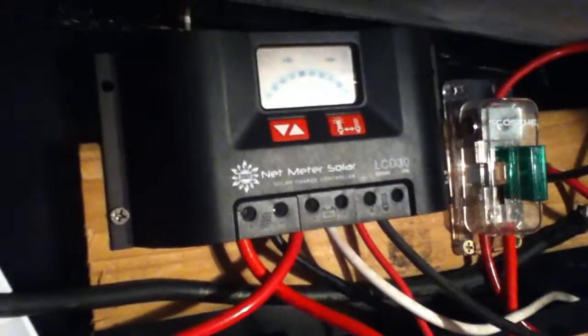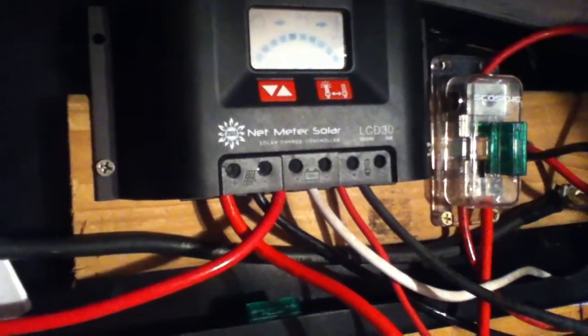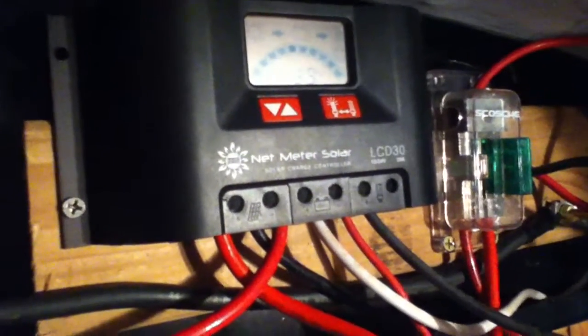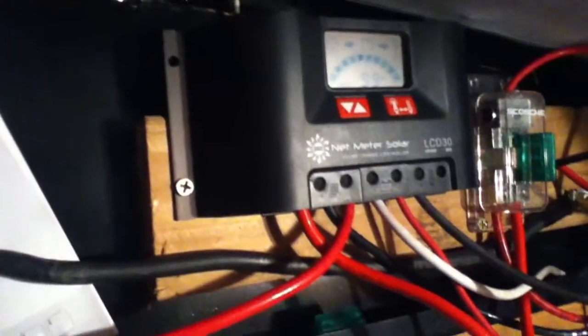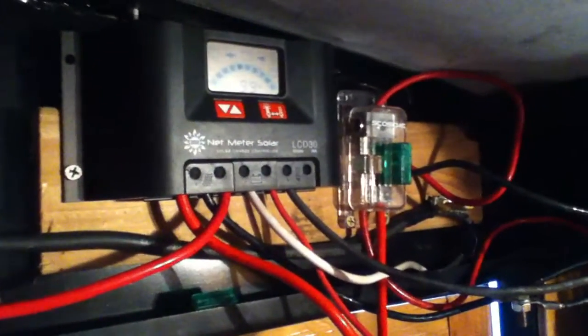Pretty basic stuff here — positive, negative, positive, negative, panel voltage coming in. I've color-coded everything. The negative battery cable is in white so I can tell it apart from the negative panel voltage. The negative on the load going to the lights is actually a gray color, and those lines are eventually going to run all the way across. This is eight gauge cable running around most of this stuff — a little thicker than spec for that voltage, but I wanted that because it's a fairly long line running to the front of the trailer.